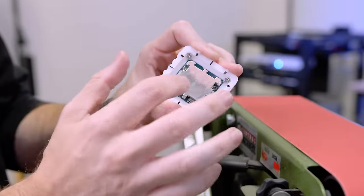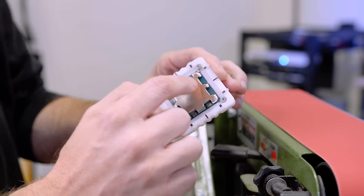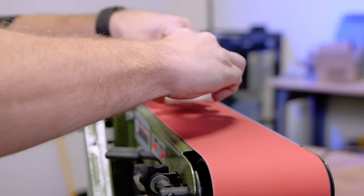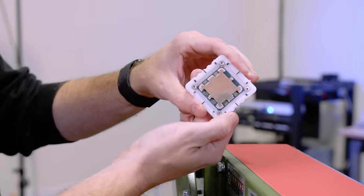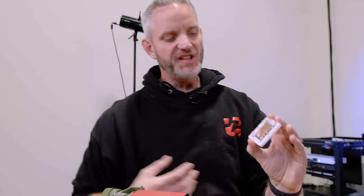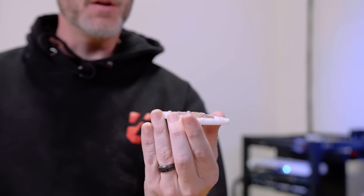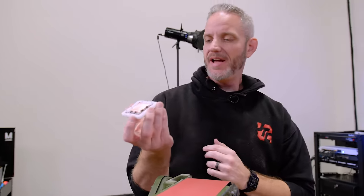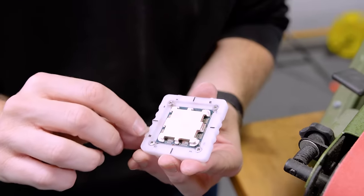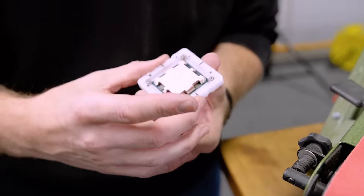We're right down to the copper now. I can see copper here but not there, so I need to make sure I'm pushing in the center. This makes short work of it. You can actually see by the shape that I'm not flat right now, but that's because I'm just getting the height down quicker and I'll be going to a finer grit on glass to make it flat. This is not precision work - this is just to get the hard work out of the way. I'm down to about one step on most sides except one corner, so I'll do the rest on glass with finer grit.